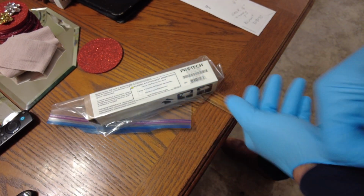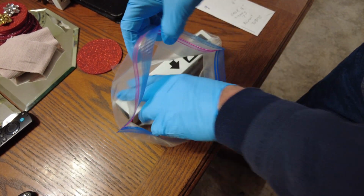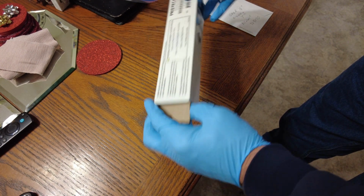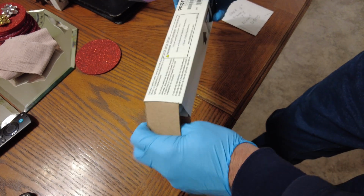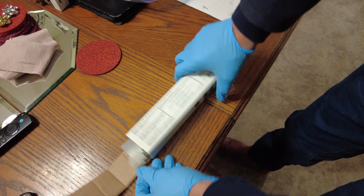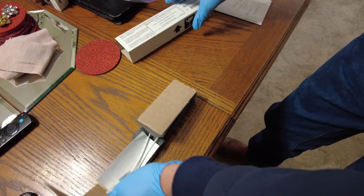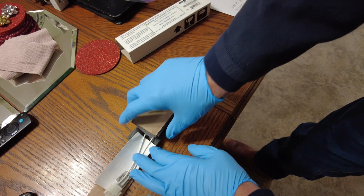One of the most important things with this is when you handle an igniter, you better put some gloves on, because the oil off your skin, if you touch this igniter, it will literally ruin it. It's like the old halogen lamps. If you touch it with your bare hands, the oil, I don't know, there's the part number. It's also handy just to have these part numbers, and you can probably buy this on Amazon, fairly inexpensive. But see how delicate the thing is? Comes wrapped in foam.